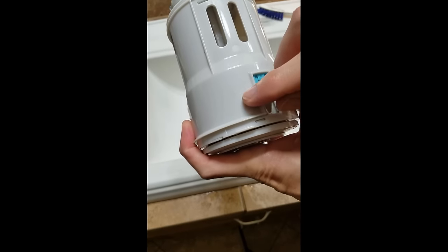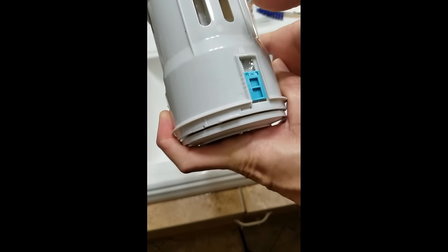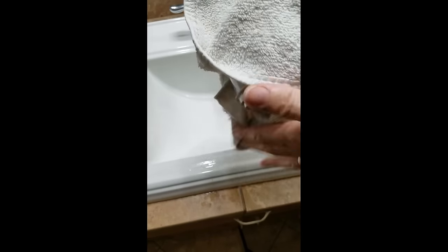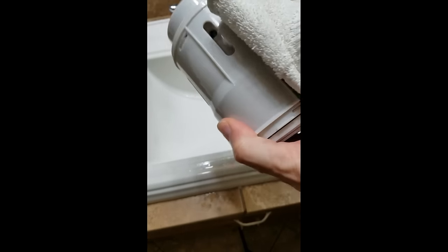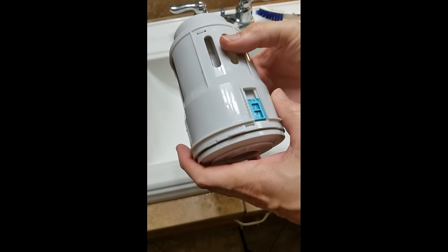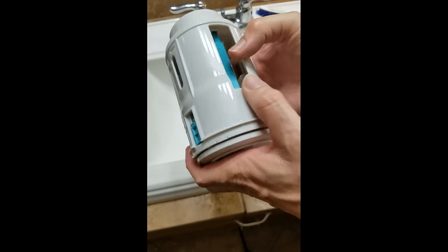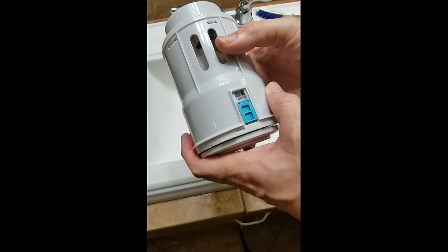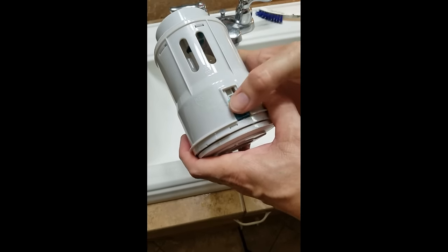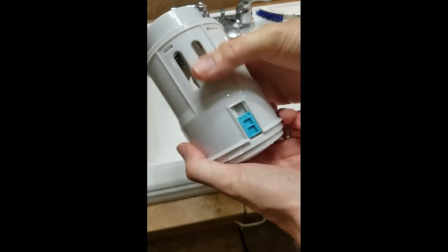It was set at minimum for the full flush — I can't have that, I've got a house full of kids. I'm going to max everything out. If you've got problems with flushing, not enough water in the bowl swishing through, you're not getting a good hard flush. Maxing these out is going to be another part of the solution.